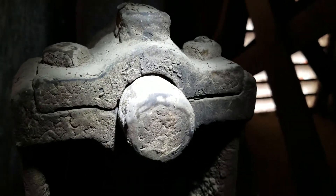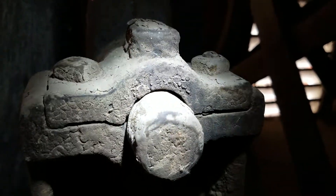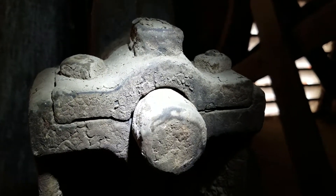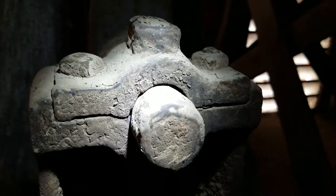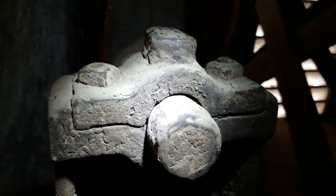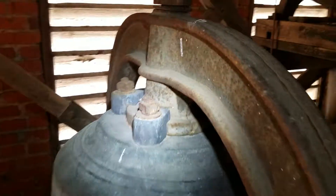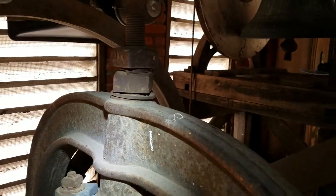These are rope-rung bells, so doing that would really help make them smoother, reduce vibration, and make them nice and easy to ring. So those are the two main things we check right away: making sure the bearing points are greased and that the head bolts are tight and in good shape.